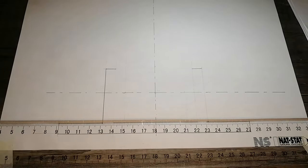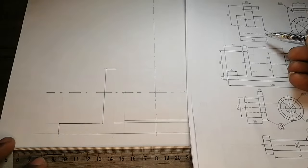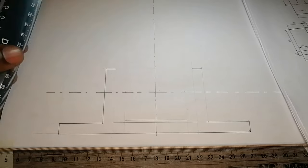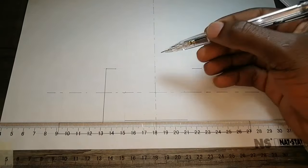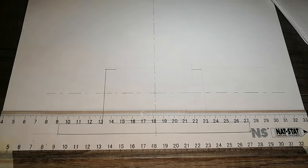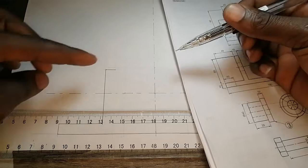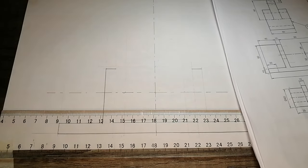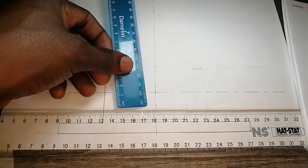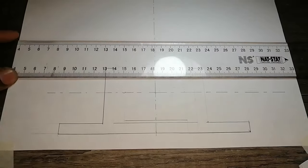Without fear or favor, you know this line will be dark here. So this line is now from here till there. It's now this one, from there till there. Going up — from here till there is that 60. Draw it faint for now. There is a reason for that — this item has got like a hook. It will be starting from there going up. How do we get the height of that hook? You are given the dimension of 60 — from here going up is 60. So from the center, 60. There is the 60, so where your 60 ends, you put a faint line there.